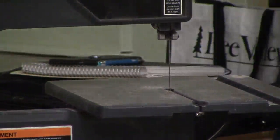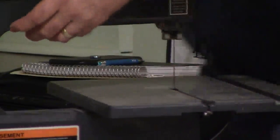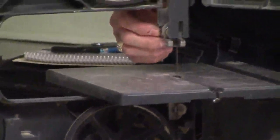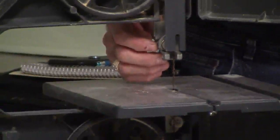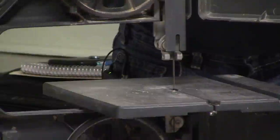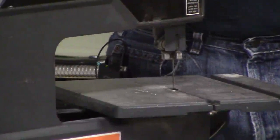The next most important things are the guides — the barriers and side supports. In many saws there's a thrust bearing, which is a little wheel just behind the back of the blade. It can be adjusted to come forward to meet the blade or go back away from the blade. You want it to be just about — but not touching — the back of the blade. The gap should be the thickness of a piece of paper or a two-dollar bill. When I turn the blade by hand, the wheel shouldn't be turning at all. You need that back support: if you cut a piece of wood and it pushes the blade back, bowing the blade — that's not good.